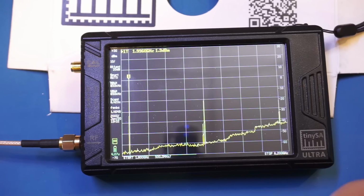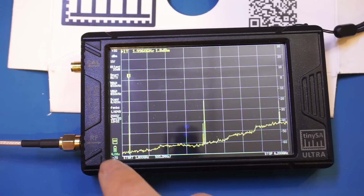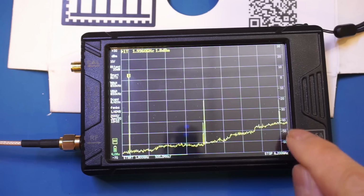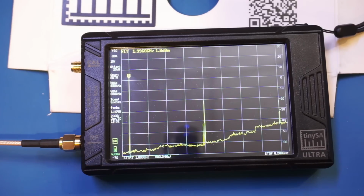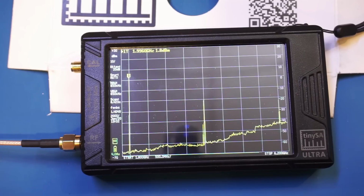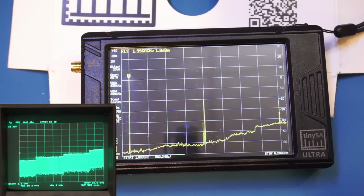What we want to see is essentially whether or not we can detect any of the signals in this higher frequency band. One thing I want to point out is as the frequency increases, the noise floor also increases as well. At the upper end here, the noise floor reaches about minus 40 dBm. This is actually very typical as we're using harmonics mixing towards the upper frequency band, and that reduces your signal to noise ratio. We see the same behavior on the HP8566B spectrum analyzer as well.